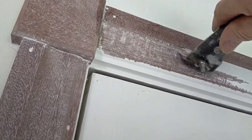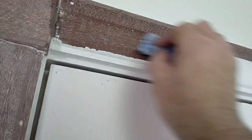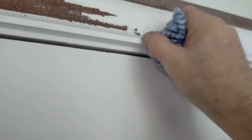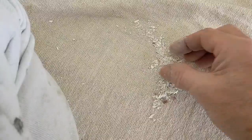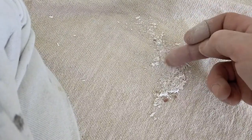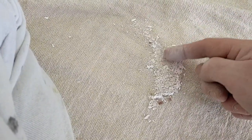Carefully. Now you get the gist there. The primer that I've put on — moisture won't go through it. This is Zinsser 123, the Bullseye. The background will just come away from underneath it. You can see the powder where it's scraped off at the top. Water-based paint just has no properties to it whatsoever — it's like putting flour on.